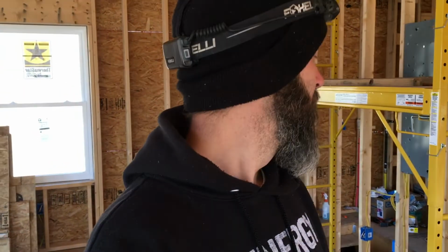I did just jump down into the crawl space just to take a good listen. As much as the soap spray works, and it does, that's how I could tell where the other leak was. I could hear it too, so if you can just quiet down once you get the system all filled up, if there's a leak, you'll probably hear it. But so far, so good on the drain and vent, and now I've got the plumbing lines to do. I'm gonna hold up for a little bit, let that sit for a while.